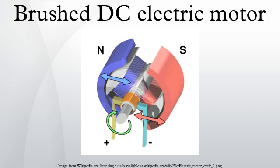Another disadvantage is that, since the coils have a measure of self-inductance, current flowing in them cannot suddenly stop. The current attempts to jump the opening gap between the commutator segment and the brush, causing arcing. Even for fans and flywheels, the clear weaknesses remaining in this design, especially that it is not self-starting from all positions, make it impractical for working use, especially considering the better alternatives that exist.